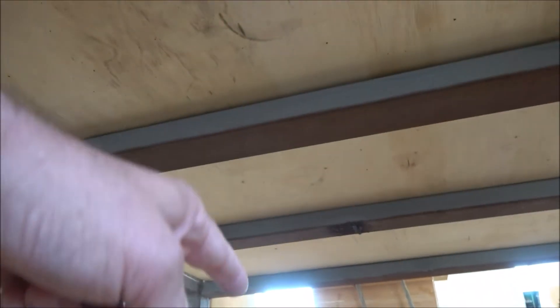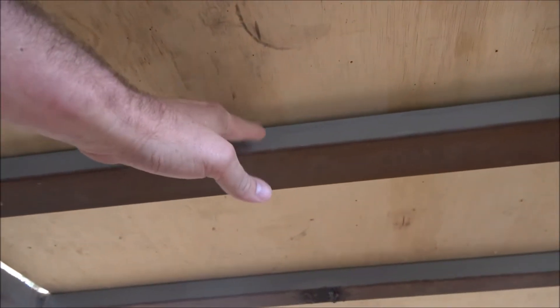I'm going to show the underside of my table for a viewer who asked. You'll see the back of the table all the way up to the front. I've added runners across — there are actually only two out there in the middle, and then we have both ends. The ends are 48 inches apart from one edge to the other. The crossmembers are spaced with the first one 18 inches from the front cross brace, the next one 16 inches from that, and then 18 inches from the end. No scientific method — I just knew it needed support. By putting those crossmembers in, I knew it was going to be more than strong enough. That's 10-gauge steel I'm using there — way overkill. It's just what I had left over from my RV and boat storage.